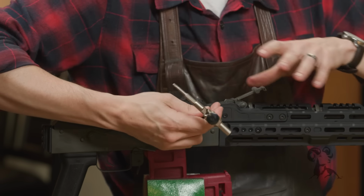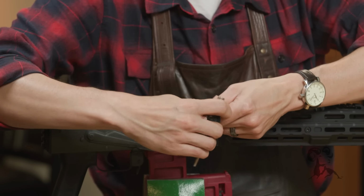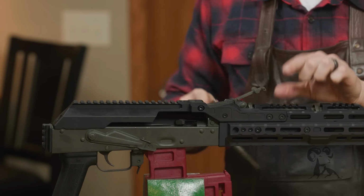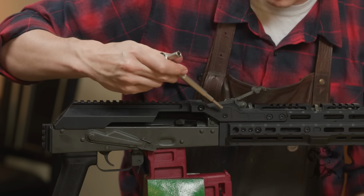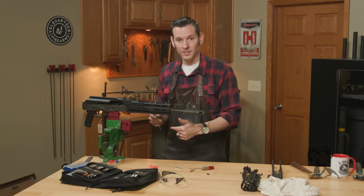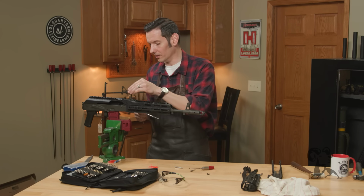And take every other screw out now. All the screws that you just installed, minus the M-lock screws. I wouldn't worry about the M-lock screws. Leave the M-lock screws in. But all of these other screws, so the screws for the metal bars, pull those out, put VibraTite on them, then put them back in at 20 inch pounds, okay? And then you're good to go.